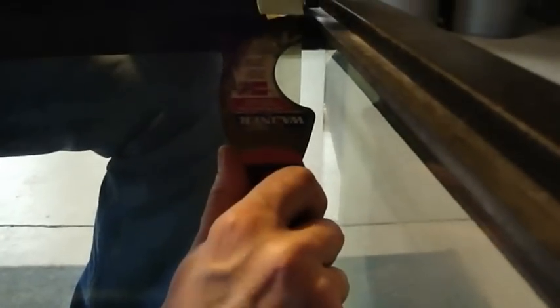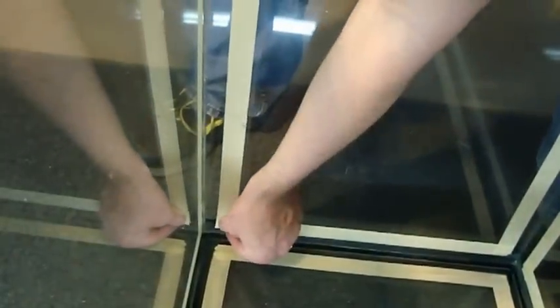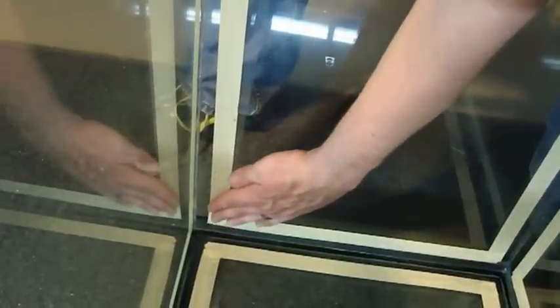Take your tape — I've gone a little wider than the factory seal, since this isn't a show tank, it's just a grow-out tank. Going wider guarantees it'll be leak-proof and gives a little extra width over the factory seam. Then take your putty knife, go up here, and just rip it straight. I'm giving myself about a quarter inch on every seam.